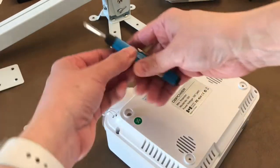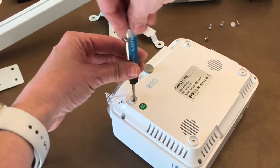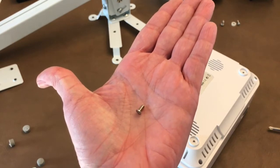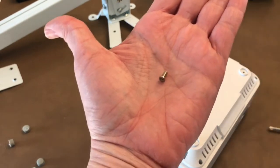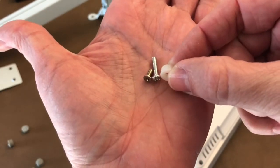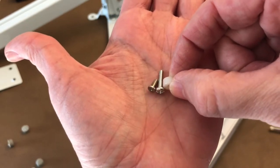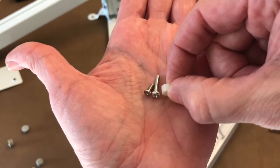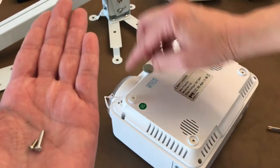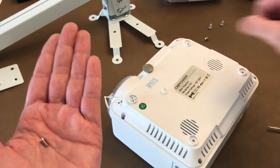For the next part, take out that small screw using a little screwdriver - it is indeed very tiny. In order to put the mount back on you're going to need a longer one; luckily the kit has another one in there. What I did to make sure it didn't go further into the casing was put a little bit of a bushing on it, so it sits above - it'll go through the metal, have the bushing, and then only go back into the threaded area just a touch. So you'll need a slightly longer screw for that one, and it'll go on top of the metal rather than into it.